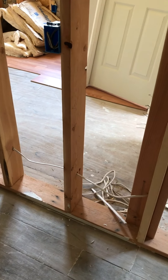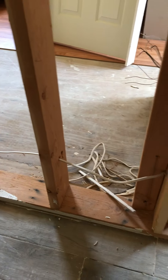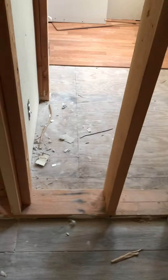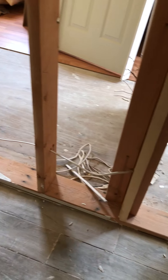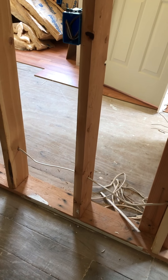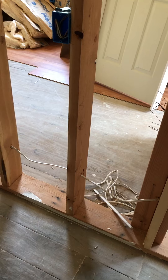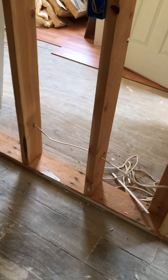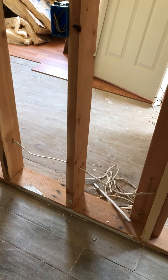We're in the bathroom of our little house and this wall is two by six construction, whereas everything else in the house is two by four construction. This is directly behind where the plumbing goes through the wall in the bathroom. The back of the bathroom has to be vented — the stack goes up through the roof and needs to go through this wall, so it will be two by six construction, which is common for most buildings. Directly behind the water closet or the tub is usually going to be two by six construction.